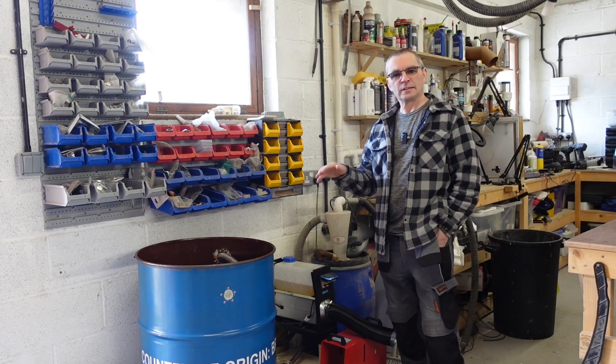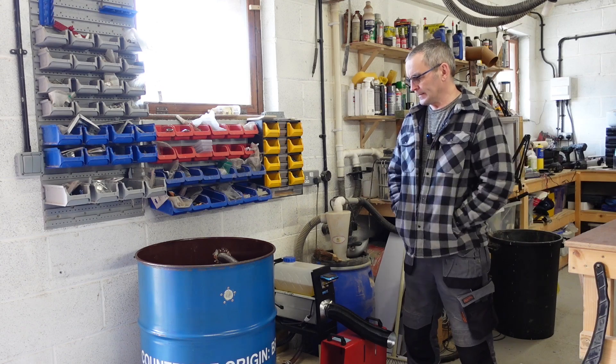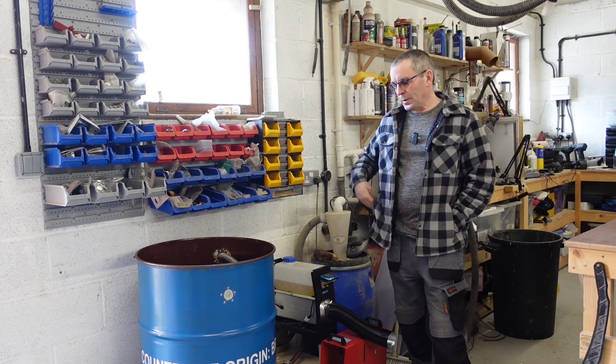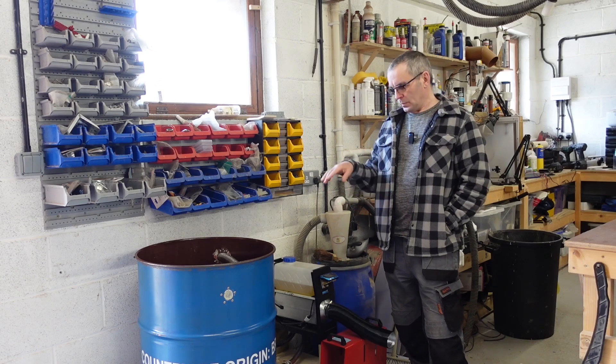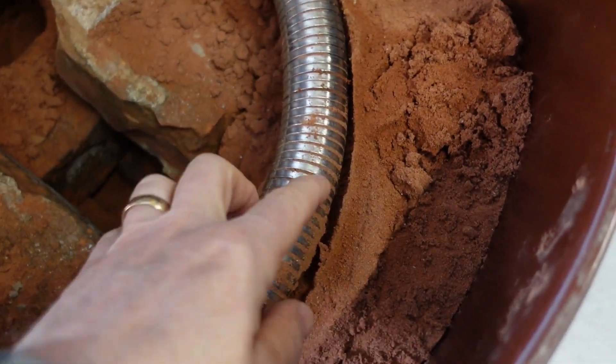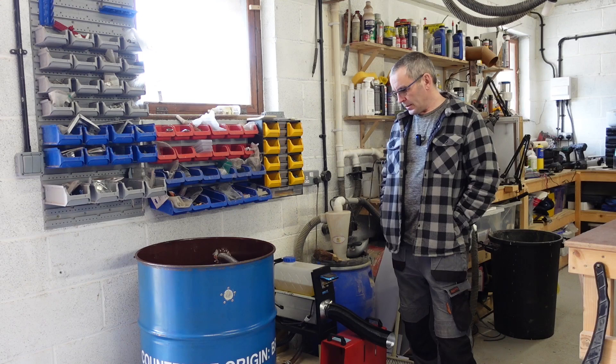The sand's wet — I used wet sand because it was cheaper. That was a mistake; should have used kiln dried sand. So if you're going to try this project, use kiln dried — it packs easier. As you can see, when it contracts as it's drying out, it leaves voids. So that was a mistake and we're going to rectify that.